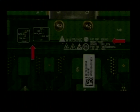Also, you notice that it has its function. It says Y driver bottom. That's really nice to have. Also, the part number. Another really good one: anything that makes a radio signal is going to have an FCC ID. You can look those up. Car alarm beepers, you want to find the right transmitter for something, look up its FCC ID. Do a Google search, do an eBay search. You'll find that by the FCC ID, even though it might be in a different colored case with a different logo on it. Any kind of stuff has documentation that's got an FCC number.